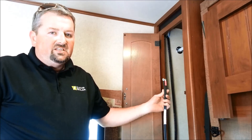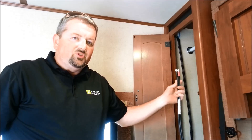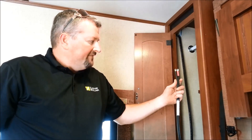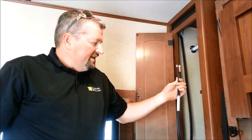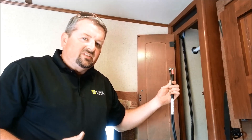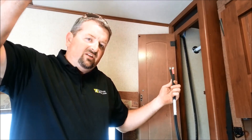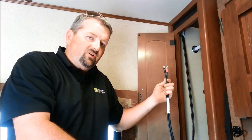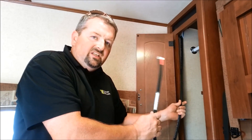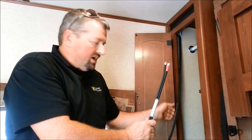This is the main cable — the large cable that goes from the roof cap to the controller, and then from the controller to the batteries. You have 25 feet of this in your kit, so don't exceed that length, because this is the proper gauge of wire for the length of runs between your panels, controller, and battery. You don't want to exceed this length.